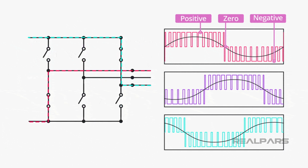We're firing positive and negative DC pulses at really fast speeds, but depending on how fast we trigger those, will simulate how many hertz we're outputting. So we may be running at 30 hertz on the motor, or we may be running in some cases 200 hertz depending on the design. In short, end of the day, an IGBT is an inverter. We are converting DC to AC so that we can control the speed of our motor that we're running. Typically for us, it's going to be a compressor with a chiller. We can get way more into the details on this and drive designs.